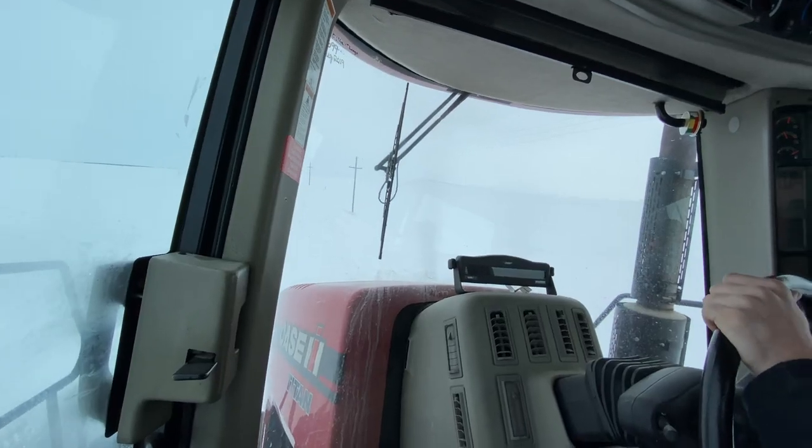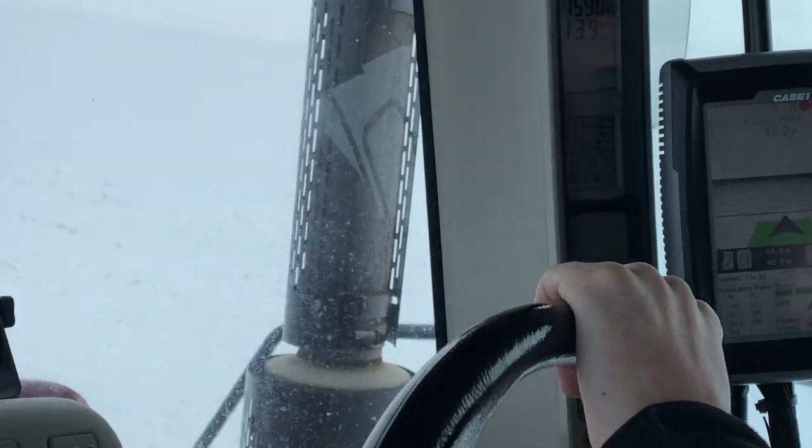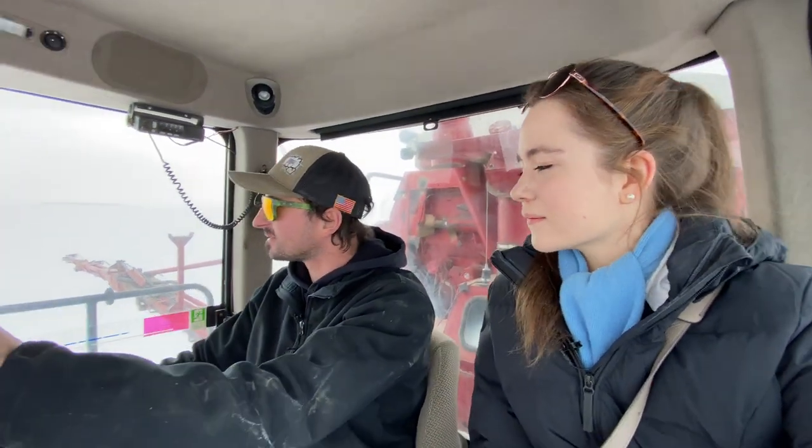And when you're spreading this heavy, you want to keep your RPM just a little higher so you don't get plugged up, so the fan speed is higher. That's really interesting - I didn't know that. If you let it come down too far, you get more of a chance of getting plugged up, and then you've got to go out and deal with it in the cold.